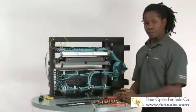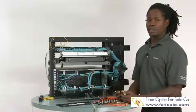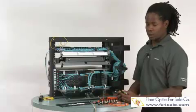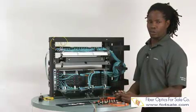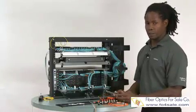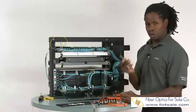I have a Corning Cable Systems VFL-350 in my hand here. It's not as complex as an OTDR, but it will definitely help you out on a job while trying to diagnose where faults are. This is a Class II laser device operating at 635 nanometers producing a red visible light. You do not want to stare directly at the beam just to be safe. It's a pen-like device — it's easy to carry around.